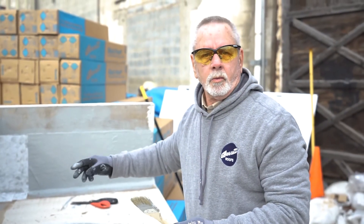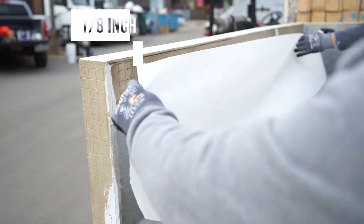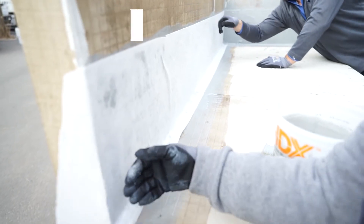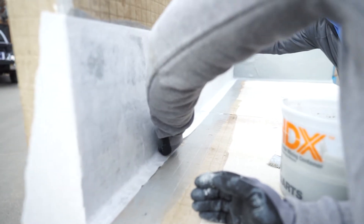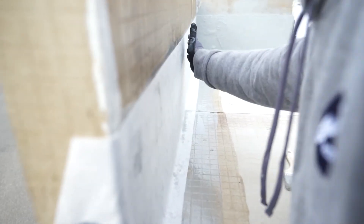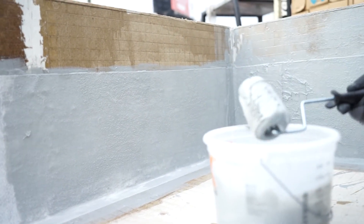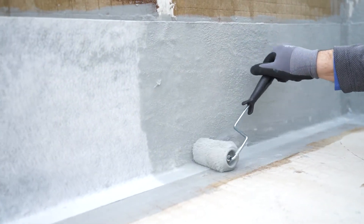I'm going to coat over the fleece with the resin so that we have this area complete. We're only leaving about an eighth of an inch of resin exposed above the fleece. As it's set in, you want to rub it in. We're looking for that fleece to turn a little bit grayish, which means it's really adhering to the wall. You want to try to get as many of the bubbles at the top out as you can — any remaining will be covered with the coat of resin we're installing. The object is to saturate the fleece 100%. Again, we're looking for that fleece to turn a grayish color; at that point we know we've covered it 100%.